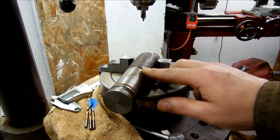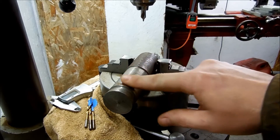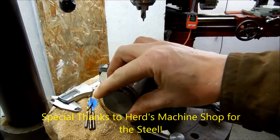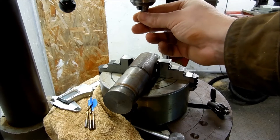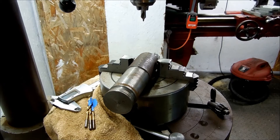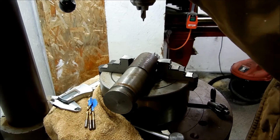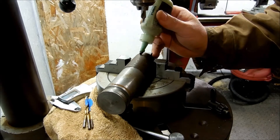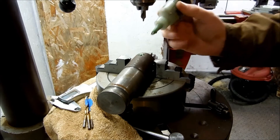Here is our piece of inch-and-a-half stress proof — at least that's what I was told when I was given it by our local machine shop. It seems to cut fairly well, so I have no reason to doubt that. I've decided to go with a smaller number three center drill so I won't have to worry about getting the hole too large from the get-go. So here we go — I need my trusty anchor lube. I really do love this stuff. It provides really good results and you don't need to make a mess — a little dab will do you.